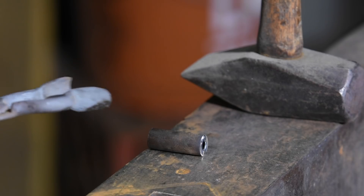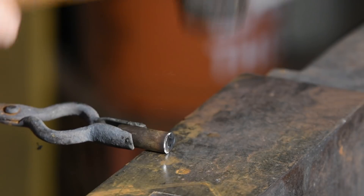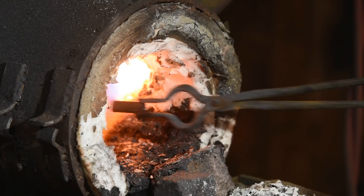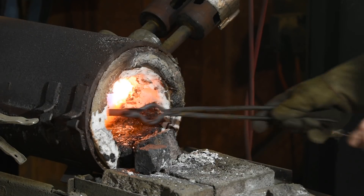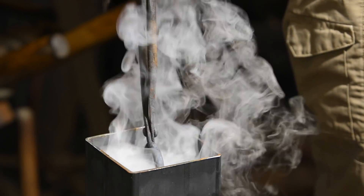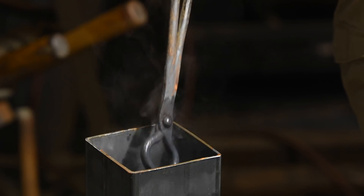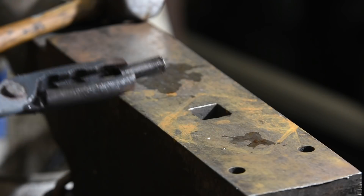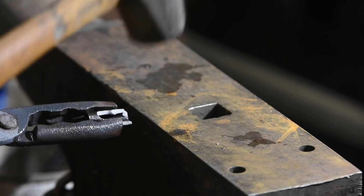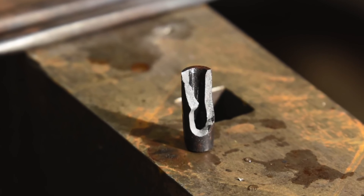I'll cut off a piece of the steel and hit it with a hammer. As you can see, the material deforms and squashes, showing that it's in a relatively soft state right now. I'll heat it up to about 1500 degrees in my forge and quench it in a bath of engineered quenching oil. If it's capable of hardening, this process ought to get the job done. This time the steel shatters, indicating that it's hardened. So this steel should work fine for our project.